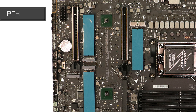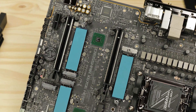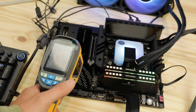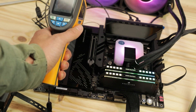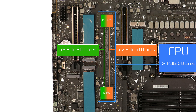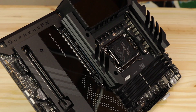Chipset-wise, the Hero is powered by AMD's brand new X670E chipset. It comes in two 7W Promontory 21 chips, placed at opposite ends of the board to avoid heat bleeding. In effect, we no longer need an active cooling solution as seen on its X570 predecessor. Instead, we have a very long and thick low-profile heat plate — not only good-looking but great at radiating the widespread heat away, keeping temps well below 50 degrees Celsius. What really sets the X670E chipset apart is that it can utilize all 20 PCIe 5.0 lanes from the CPU, allowing much broader PCIe 5.0 support than on preceding models.